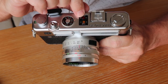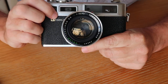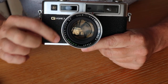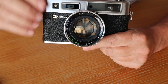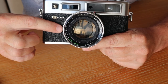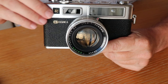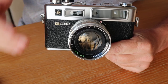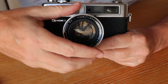It's more important that the overexposure warning bulb works than the underexposure one, because no matter how slow the shutter speed goes you'll get a correct exposure in low light. But the Yashica has a maximum shutter speed that is relatively low, so it's important to know when you're at the limit. The next major problem in these cameras is the POD - or 'pad of death' - a urethane spacer between the slider switch and the shutter button that maintains proper contact spacing, otherwise you get inconsistent shutter speeds or the shutter may stick.